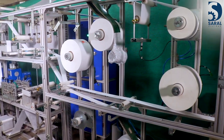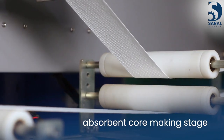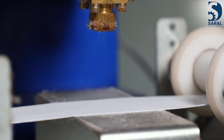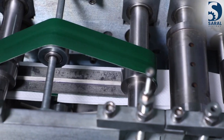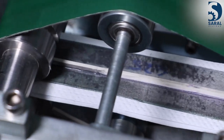There are 7 raw materials in a typical sanitary napkin. First, the air laid sheet and the super absorbent sheet are glued together with non-water-soluble construction glue. These combined layers are then cut by the core cutting unit in the required core size, which are then separated in the core cutting module.